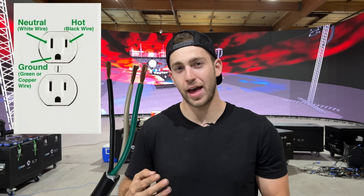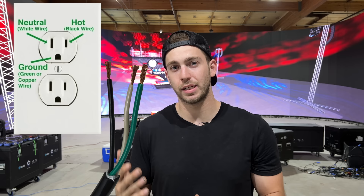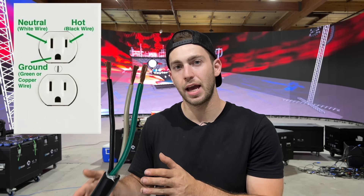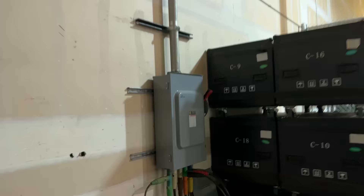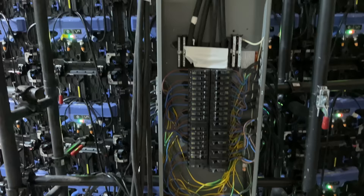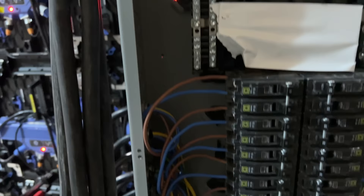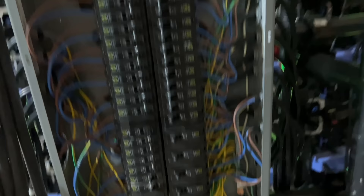Let me break down 240 volts. Your standard house outlet is 120 volts and has three things: a lead carrying the current (black wire), a neutral (white wire), and a ground (green wire). Power goes down the lead — one cable carrying your power. To get to 240 volts, instead of a lead and a neutral, you have two leads and a ground — no neutral. In your breaker box, you have two circuits, each with a 20-amp, 120-volt lead, wired to a single PowerCon. Still three cables: a lead, another lead, and a ground. They combine together and give you 240 volts.